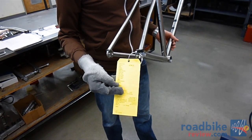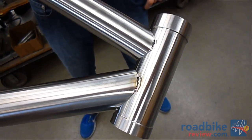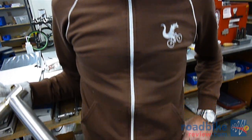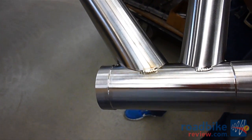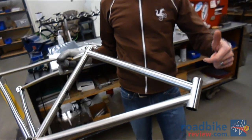That yellow tag goes out to our customers so they can see who touched their frames. Here we've got a Moots fusion tack weld. This has come out of the mainframe jig and is tacked into place so it holds its angles. Then it'll go off to the mainframe welders. We do this to hold the shape.